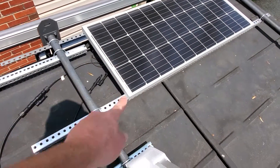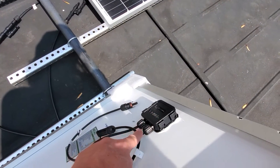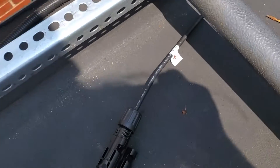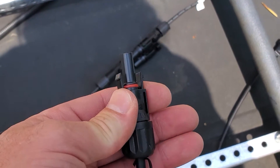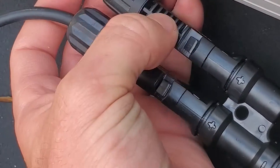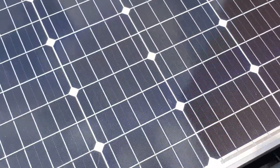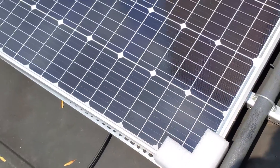Now we can get the other solar panel. For ease of access, just make sure your junction boxes are close — one junction box is at the top of that panel and this junction box is here, so I'm aiming them to be closest to each other and easy to reach. Just verify that your positive is in fact going to match; it should be universal but double check. Then you should have two cables going to each branch connector, one cable going to each panel, not matching going to the same branch. Now I should have just doubled the wattage on my solar system.